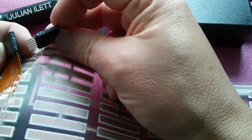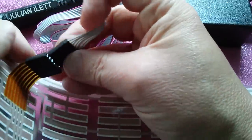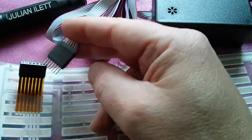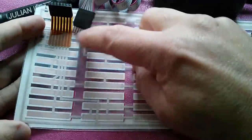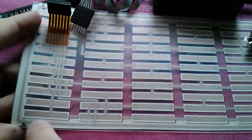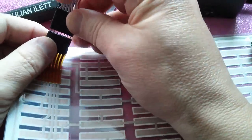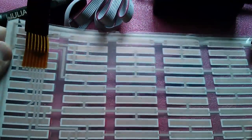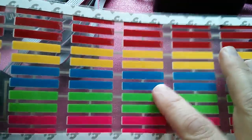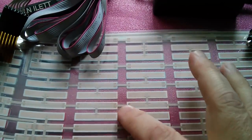So a couple of clues. We've got some markings on the edge of the heat shrink. Could that be the pin one indications? There are no similar markings on the other side. This has the red wire, so that is generally pin one, and this end track runs down to this track which runs all around the outside. So I'm guessing, or I'm hoping, that it's a fairly safe bet that it goes that way around. Now looking at these things, I'm not so sure whether these are LEDs — I'm just wondering whether these are electroluminescent, or something like that.